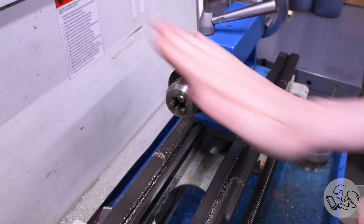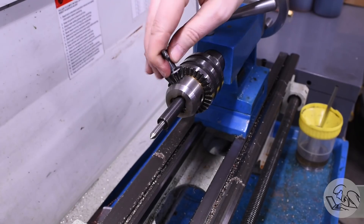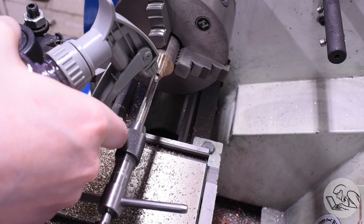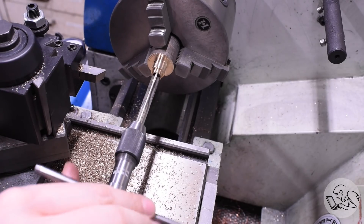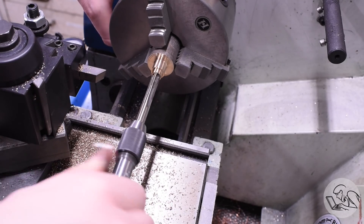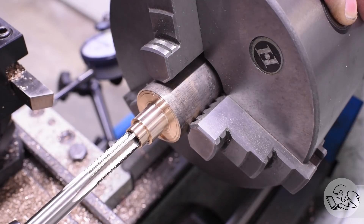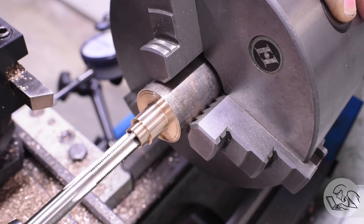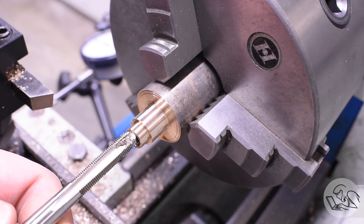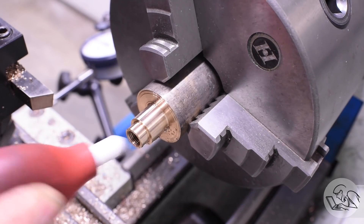Now I can go in with a spring-loaded tap follower. Your forearm makes a great high-speed chuck adjustment tool, and in we go with the tap. I'm going straight in with the bottom tap here - not using a taper tap because this hole just isn't deep enough for the taper tap to have much effect, and when you're tapping on the lathe you don't really need to go in with the taper tap first anyway - the lathe is keeping it straight for us. And the obligatory squeezy air so we can admire our handiwork. That's looking pretty nice.